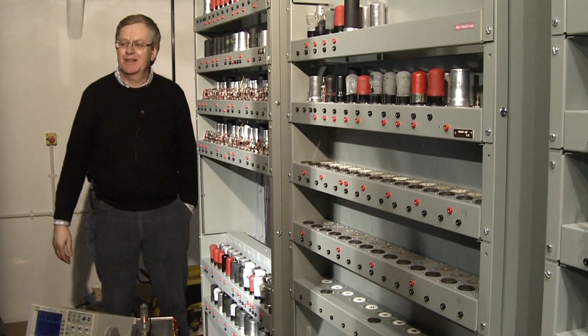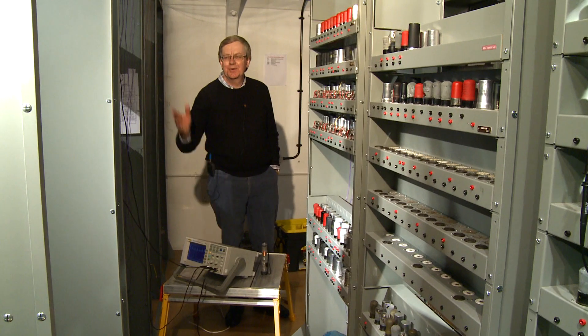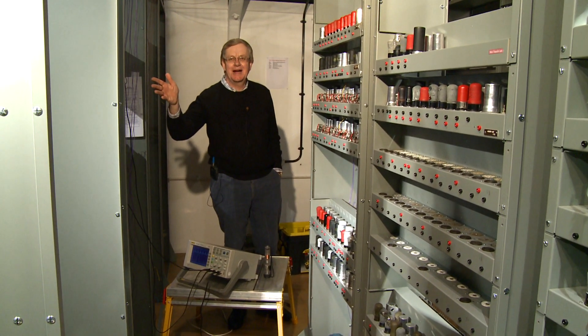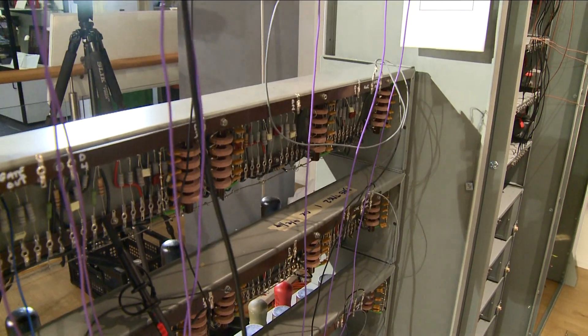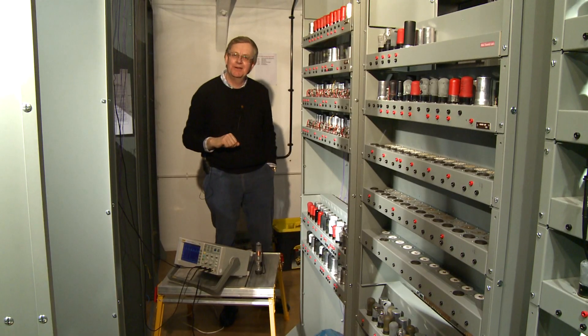As part of that commissioning, we find ourselves using tools like this oscilloscope. We can monitor the signals coming out of a chassis — these are generating clock and digit pulses — and trace them round to other parts of the machine where they're being used.